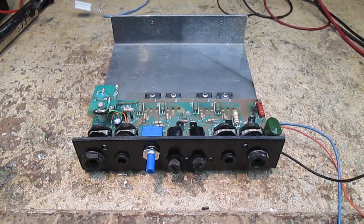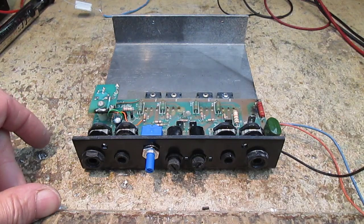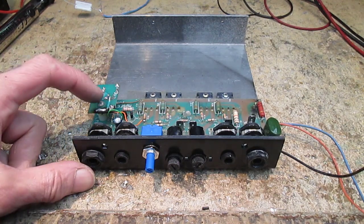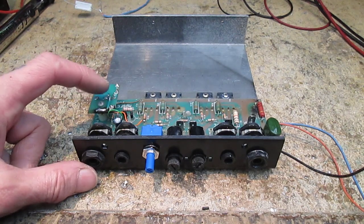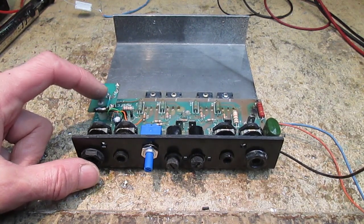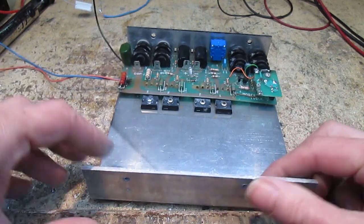So that's the good working channel, loosely put in. The output devices are screwed down. At the moment these are 3mm M3 bolts in there, but I've been trying to fit the 4mm bolt that came with the amp into here. I realised it isn't metric threads, it's BA. So I found a 4BA.